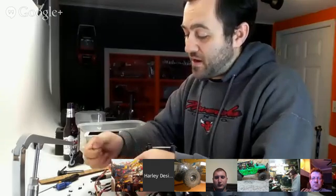Our airplanes have way different speed controls because I have a jet, an F-86. I run a 160 amp ESC, and I run a 5,000 mAh 6-cell in it. Right. So yeah, that will draw constant 120 amps. What's that? We're putting a meter on it. I can see that it draws almost a constant 120 amps during takeoff. Yeah, that's not a small amount of power. That's for sure. No, it's a big EDF jet. Right. 6 pounds of styrofoam. That is a lot of styrofoam. That's a lot of foam-safe glue after you're done.